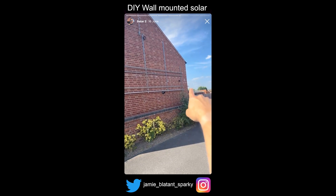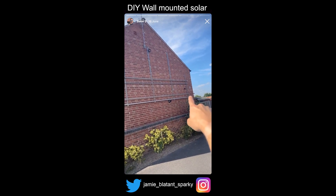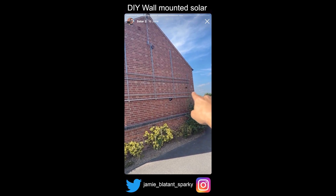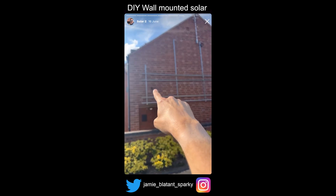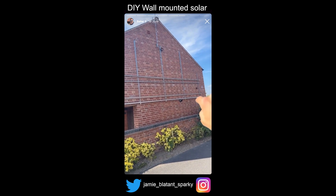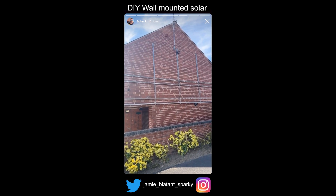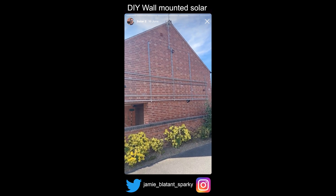Up there there'll be two that way. There's a little black conduit so I'm going to get those cables through tomorrow. Thanks to the DMH guy - I'm going to run one cable all the way down to here, leave a loop, and the other cable I'll just leave in a loop there, then plug those as required. I'll go in one, in two, in three, up through that one, through that one, and through that one, then back out - just leave a loop there. I'm only hoping to get these five panels up this weekend just to get my inverter working.